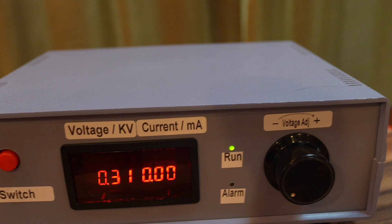The amperage value should always be zero, indicating that we are at microcurrent levels. The unit will turn off at approximately 4 milliamps. If you see that the amperage is not zero, that's your indication that either you have a poor ground at your outlet, or that you're not properly insulated from ground and you need to raise the conductive pad — whether that's stainless steel or carbon fiber — off the ground more.